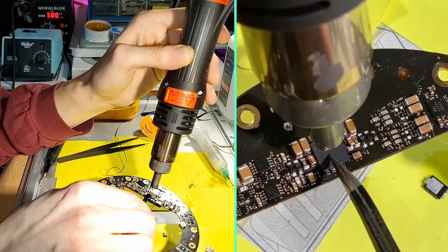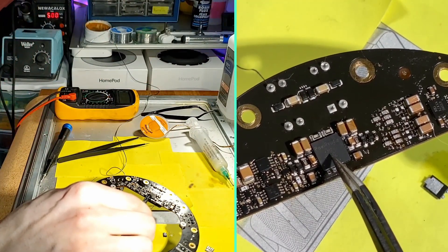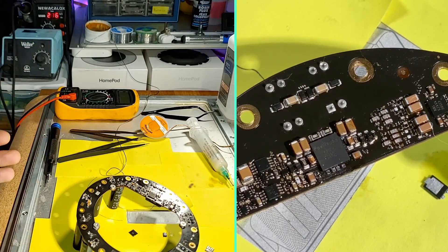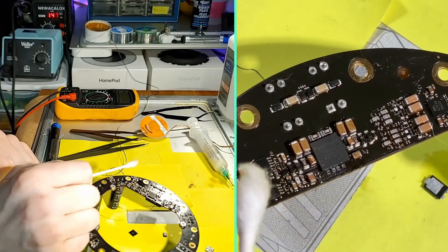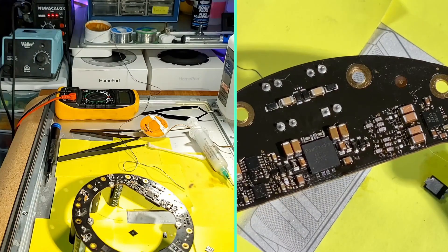When we're happy with how the solder's melted and the chip's placement, we'll hold that down with our tweezers, take the heat away, and keep holding for a few more seconds. Then we can give this a quick clean with some rubbing alcohol and throw this together for a quick test to see if our repair was successful. Worst case, if you bridged any of the pads it may short your amp IC and you'll need to replace the chip again. If you didn't line it up just right or not all your pads made a complete connection, you won't have any subwoofer volume and you'll just need to try again. That's about all I have for this video. I hope you found this helpful and we can bring more HomePods back from the grave. Subscribe and follow me on social media to keep in touch with the latest HomePod repairs, hacks, and more. Thanks for watching. Bye!